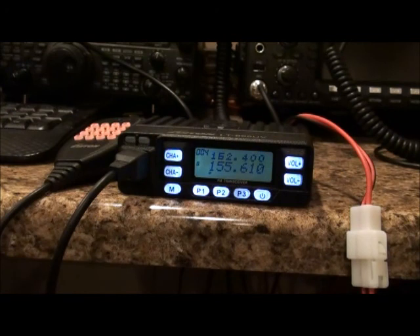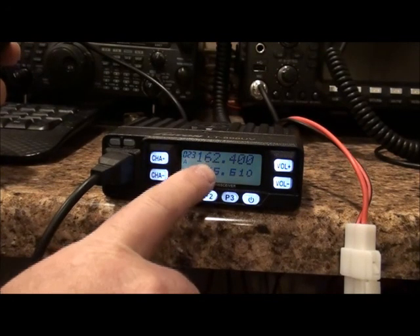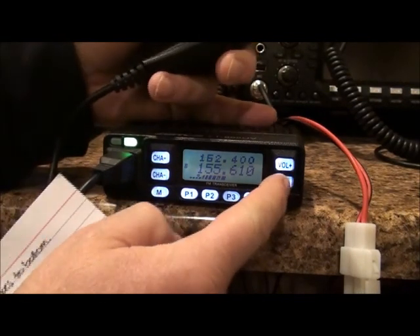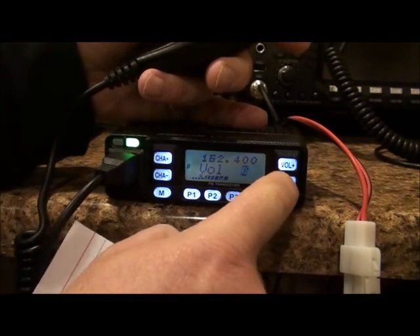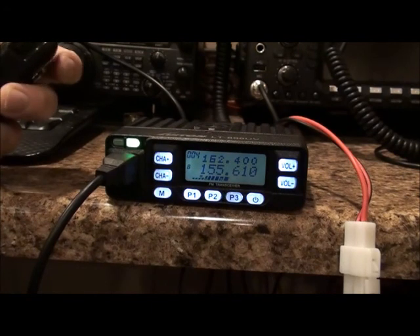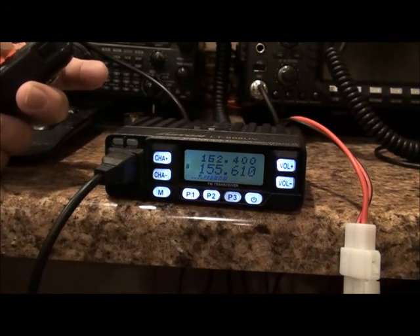I went through the manual and took down some notes. I'm going to tell you guys the quickest way I found to program these. I'll use the C button — see how the big numbers are on top — I'm going to put it on the bottom, that's the VFO. That's my local dispatch frequency. Now I'm going to switch from memory — you can see I had channel 4 — and now there's nothing, so I'm in VFO mode.